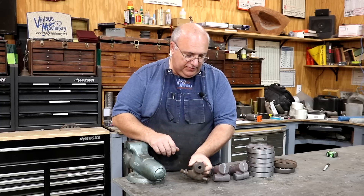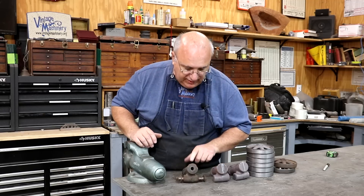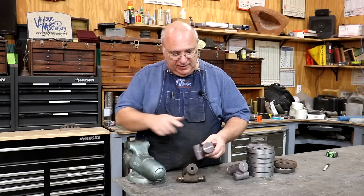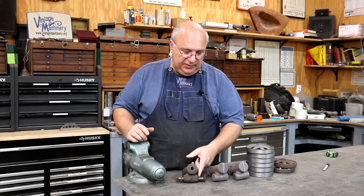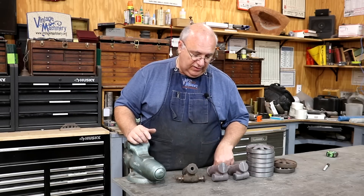So we've got some machining to do here. Like I said, drill and then counter bore. This one, we'll have to cross-drill this one. Also, the ends of these two need to be milled out flat and to the correct width. We're going to have to make an axle to go in here. This axle looks like it's riveted in place. I may need to pull this one out to see exactly how they did that, where it would wobble like it does.